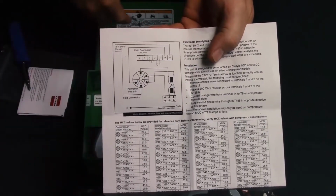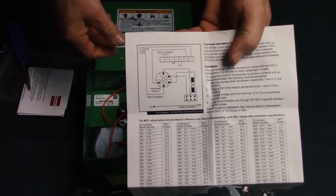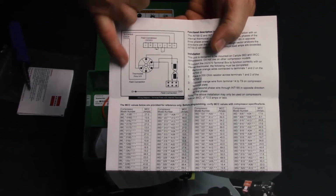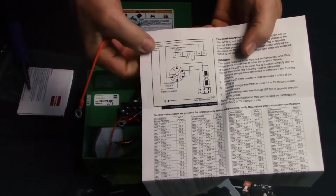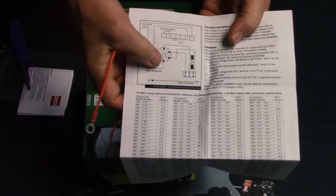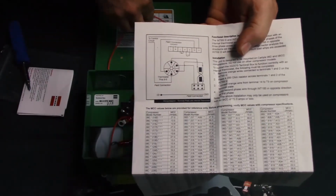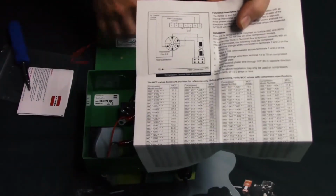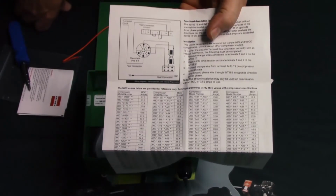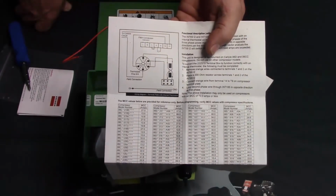And so when you're connecting it to the compressor, you take the one that we've already connected, in this case it's the number 11, that's going to connect out to your circuit, and then you're going to bring back another wire, which is your current loose one that you have not used yet, and that's going to go to terminal pin 8. And then terminal pin 9 comes across and ties into 14. So what you're going to do is this last one is going to come across and tie to terminal pin 9. That concludes hooking this up with a bimetallic thermostat.